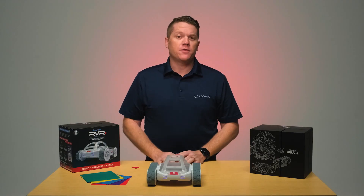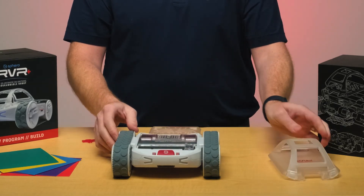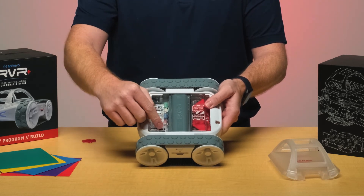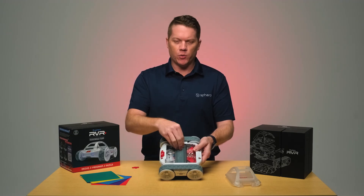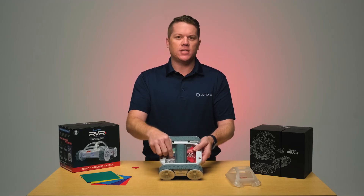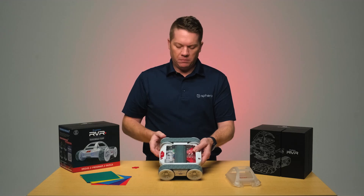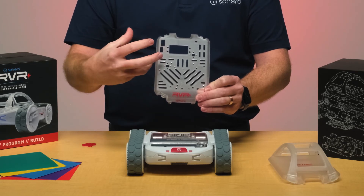So let's talk about Rover Plus for our more advanced students who want to take their programming even further. If you remove the roll cage from the Rover Plus, there are going to be two ports that you'll notice that are exposed when you lift this door. There is a USB port and there's also a UART port. The USB port allows you to power things and draw from the Rover Plus battery like a micro:bit or a Raspberry Pi. The UART port allows you to connect RX and TX pins to a Raspberry Pi to program your Rover Plus with Python in the Raspberry Pi platform. The developer plate has a lot of different slots and holes for you to be able to mount your hardware in a lot of different configurations, and it goes on top of the Rover Plus just like the regular cover plate.